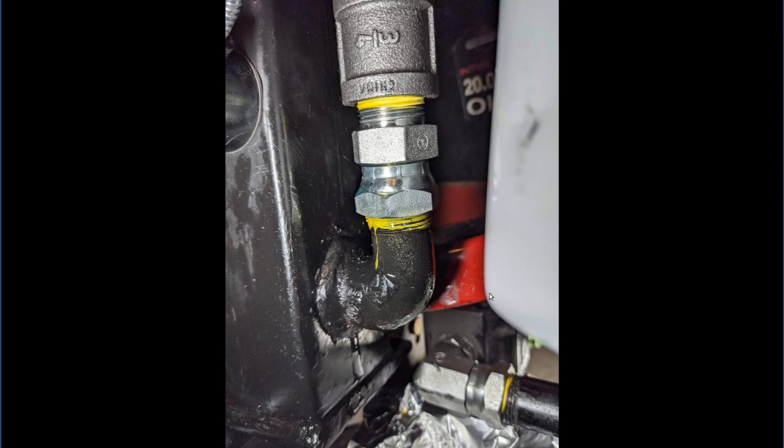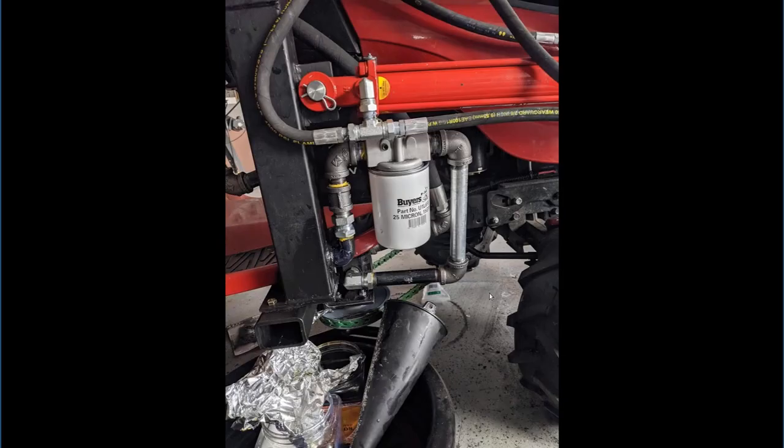Also in this picture, I have hydraulic fittings on the suction side. It turns out that even though the threads are NPT, the hydraulic fittings are expecting the cut end to fit — they rely on the shape of a hydraulic hose end to fit into these swivel fittings. I needed swivel fittings because I was supposed to get all the pieces together first and then weld on. The problem is that with MIG welding using a cup, there's not a lot of room to get a good weld when all pieces are in place. I couldn't keep this swivel fitting and needed to tear the whole thing apart and rebuild the tank.